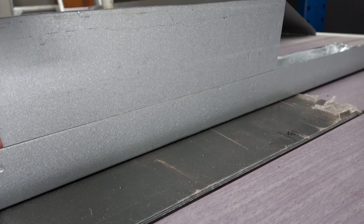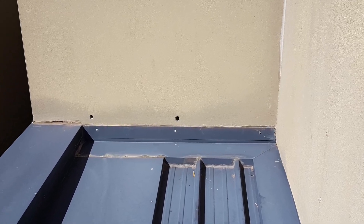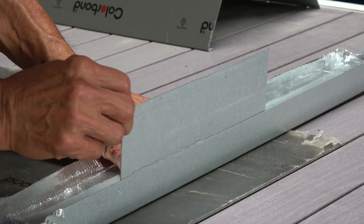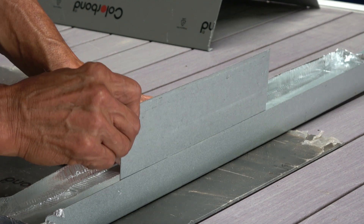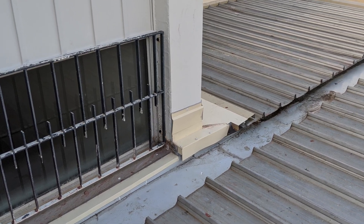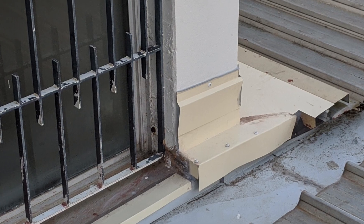What you've just seen here is the typical installation where you've got an apron flashing and then a wall flashing that covers the apron flashing. Where the two — the apron flashing and the wall flashing — are touching and you've got a bit of wind, you've got water that is sucked up and partially pumped up. It goes over the edge of the apron and into the roof cavity. So it's up to the installer to design a flashing with a little bit of a feather on it so that you don't get that capillary reaction happening — and that's entirely up to the installer.